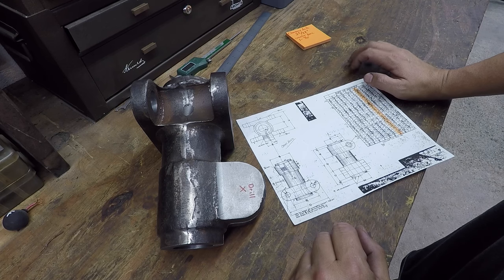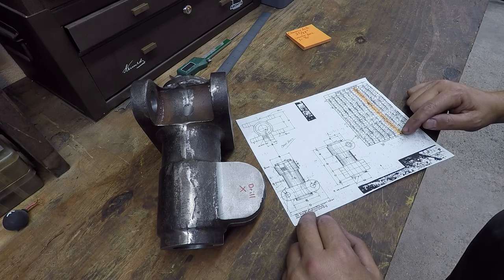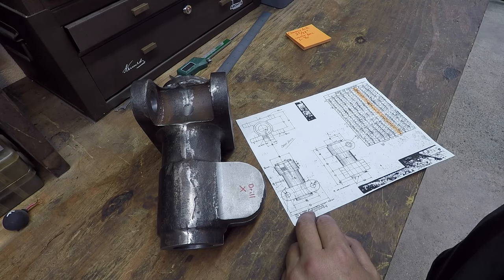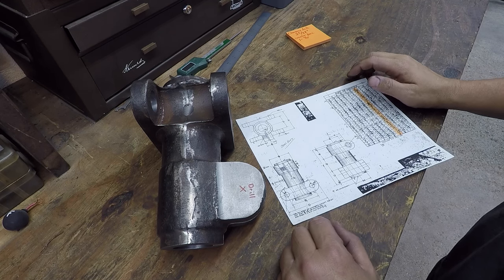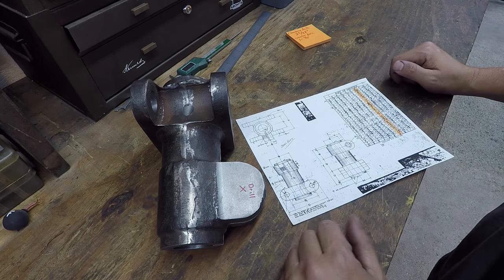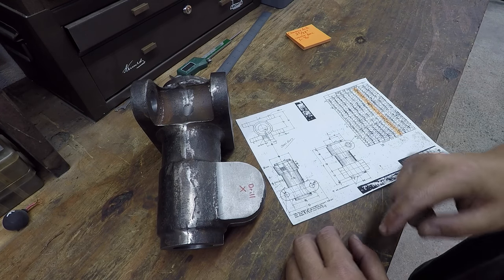It says U.S. standard tap, which is going to be a size 7/8, but it doesn't tell me if it's coarse or fine thread, so I don't know. I want him to let me know what size bolt he's got. I mean, if he's got the actual bolt there, or if he's going to purchase one. I'm not really sure, so I need to verify the thread pitch.